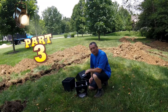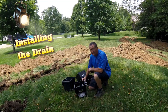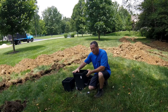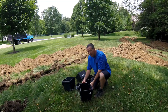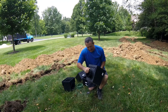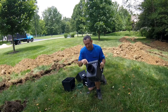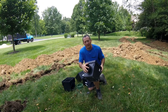To get started installing the French drain system, I'm going to put the primary catch basins in place first. These are the receptacles that catch most of the water. They'll have a grate across the top, level or just slightly below the grass surface. They go together pretty easy — they have a connector that twist-locks in place, and then you slide your pipe into this side. I usually put one or two screws in to hold the pipe while assembling the whole drainage system.